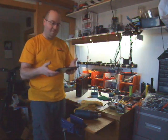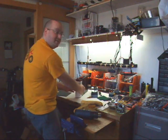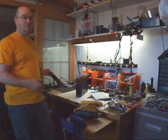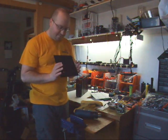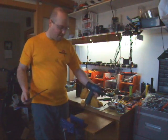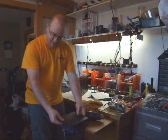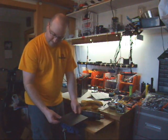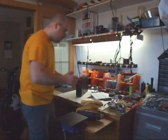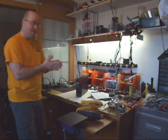The challenging part is I need to bend this to look like that. I haven't tried this yet. I've bent square and 90-degree shapes, but I haven't tried doing a round shape for this kind of project. So I put a bench vise down, got the heat gun, got a piece of plastic that I've already cut and drilled my holes. If I center it over the vise and heat the middle to soften it up, I should be able to hold it with gloves and put it on the box.